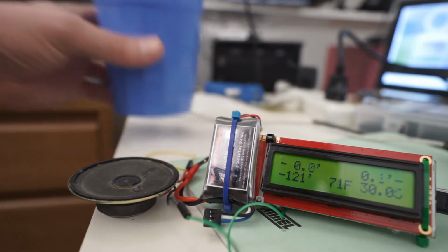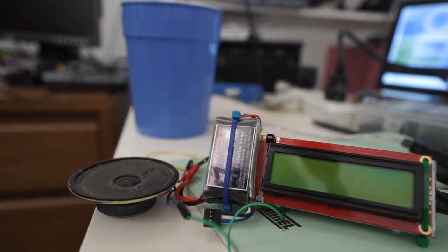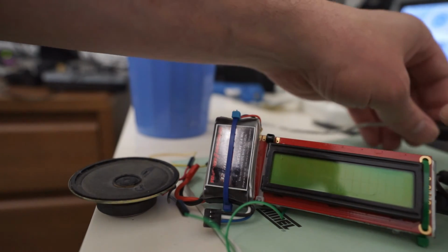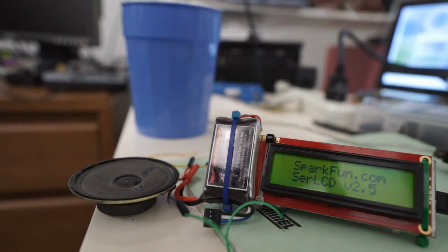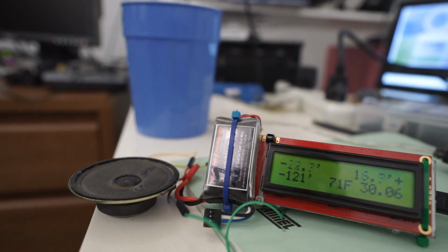And then the sweeping sounds at the beginning also, I believe, are a consequence of the linear regression math. First when it starts up, it starts at 0, and then it needs to hunt to the value that it's at, and then it does a calibration step, and then it needs to hunt for that new value, and then it overcompensates. The model drives it, overshoots the value, and then it comes back. This would be a similar kind of sound, just like a moving average would do sort of the same thing.